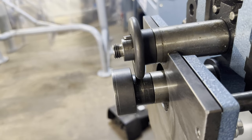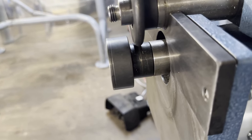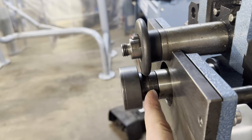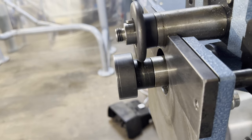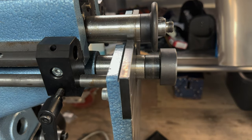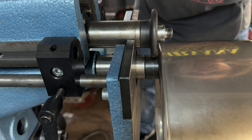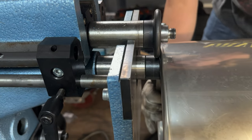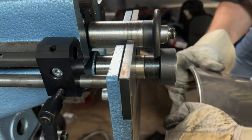Here I have put the upper wheel - I didn't put anything here, so now I can move and I have the down wheel. The under wheel is with a flat swage and the upper wheel is a normal swage wheel. I put out the ring here, and now I can put this wheel until the end so I have room for squeezing. The next step: I'm going to put this edge here behind, put the upper wheel down, move it to the front, fix it, then slide it around and pull it in the rounding direction.